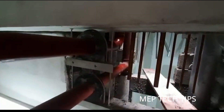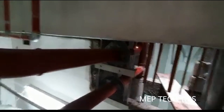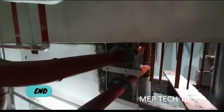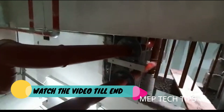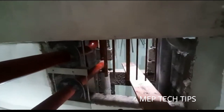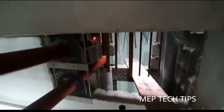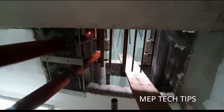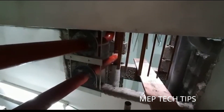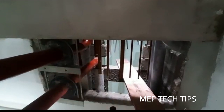This is the rectification — if you have a better idea, please let me know your view. The shaft is too tight; ducting is also going to come in this shaft, and due to that we cannot extend more outward here. We have to stay along the wall side. If I keep these two pipes along the wall, then again we have a problem with the T direction.